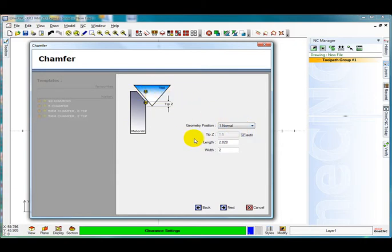Now you know on the drawings it always asks you for either a 2x45, 3x45, or a 6x45 chamfer around the job. Well this is this area here in the width — this is the area for the size of chamfer you require. We will leave it on automatic because it adjusts itself to find the equal of the length. So if I wanted a 5mm chamfer I would put 5 in there and then it calculates the length — which is actually the hypotenuse. So if I said a 1mm chamfer it would work out the hypotenuse would be 1.414. So for a size of chamfer I am going to put a 2x45 chamfer.